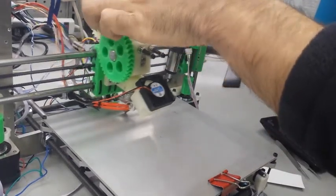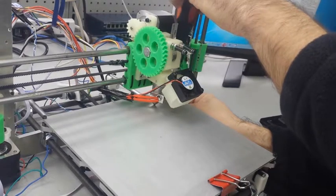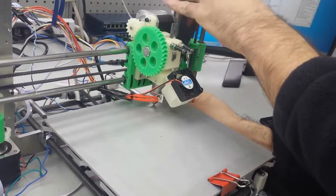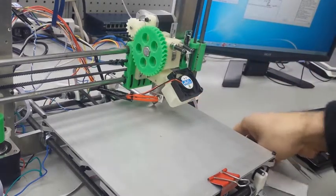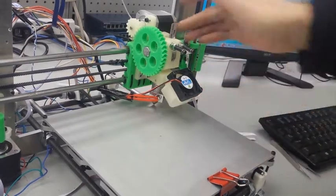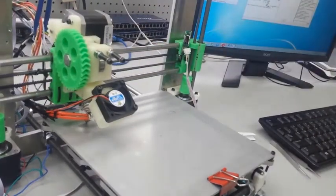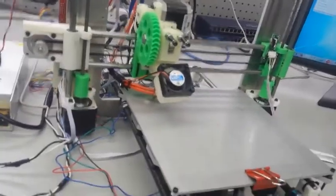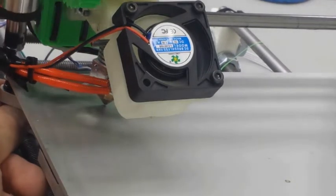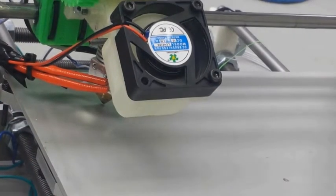Now, from this angle, it's going to be hard to fully see what I'm doing, but I'm tightening the spring just a little bit, and this is where you can finally see the benefit of having the spring-mounted corners. You can imagine how much more difficult this would be if the heat bed was fixed. Now I want to get it to where I can get a folded piece of paper underneath it, and just a tiny bit of a gap. Because just like with everything else we've calibrated, there is a sweet spot for the height, and it can be a little hard to achieve sometimes.